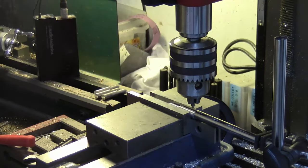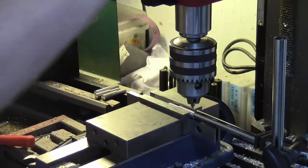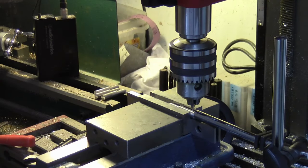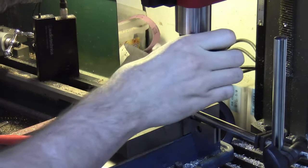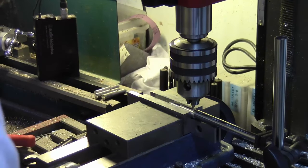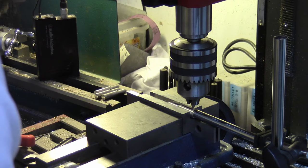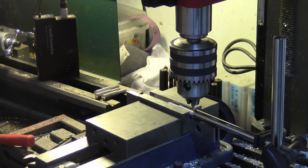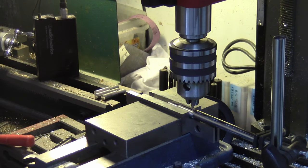Our diameter has changed so we're going to find center this way as well. I'm literally just eyeballing this - I don't need it to be perfect. I just want a hole for the spring to grab into. I think we're going to come up about 3/16 or so from the end - looks good. I'll lock everything in place because I don't need anything to move now. We're just going to center drill - get all four of them center drilled. Let's turn on the machine.